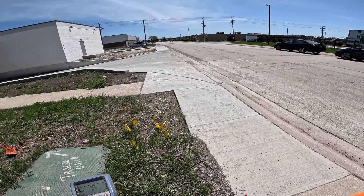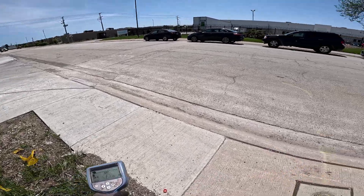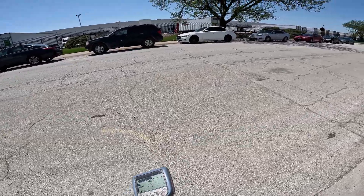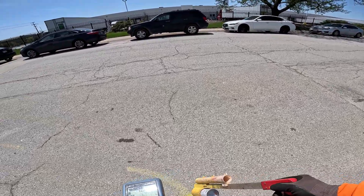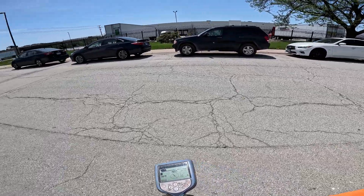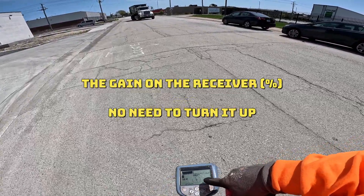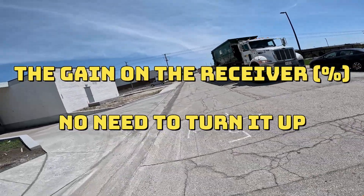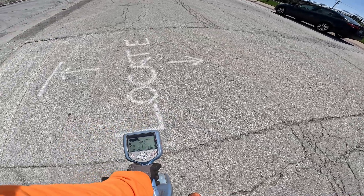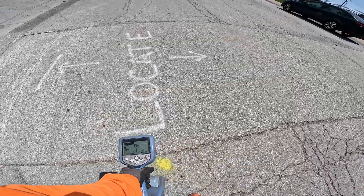Out here I got nothing where those flags are. I sweep and it turned — I got it right in the road. Right here I lost it, so I'm doing another sweep. I'm not moving my receiver at all, my percentage is still the same. I'm still at 27 milliamps at four feet, so the main's deeper out here.